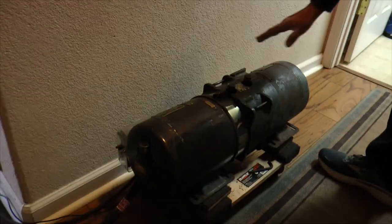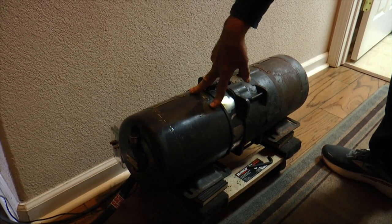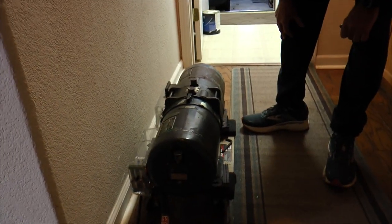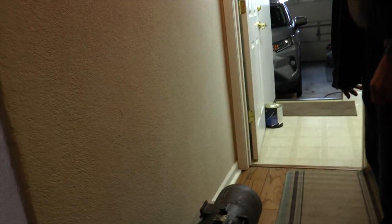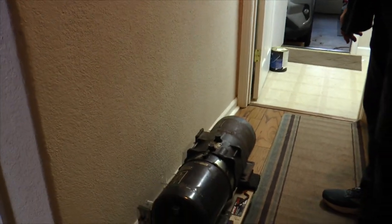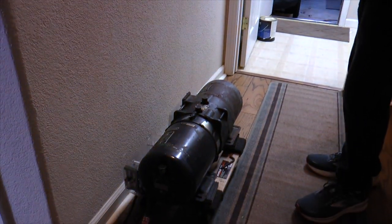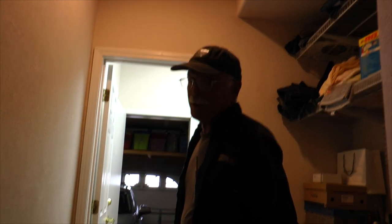This is the motor generator set. The one horsepower motor, three-phase 220, driving at 500 volts. It's a dual winding armature, which is really something nobody makes anymore. Long story on rebuilds for this. This was all torn down, took all the windings out, cleaned, baked them all in the oven, measured them, re-insulated, new bearings and brushes, the rest. The first one ran for a month before the generator burned out. This is generator number two, which had no issues, and I think it's going to be good for another several years.